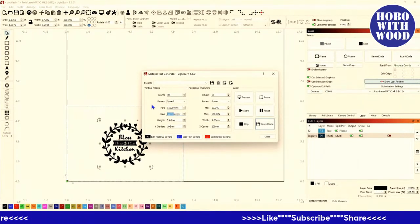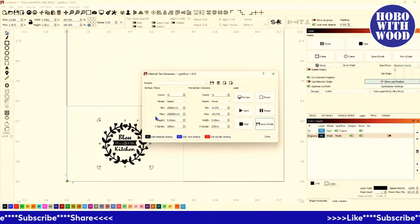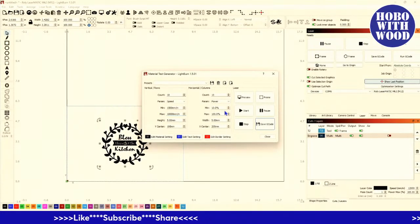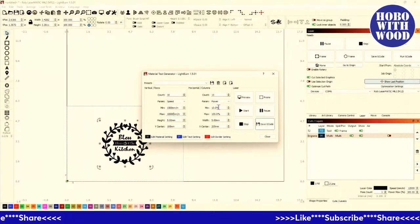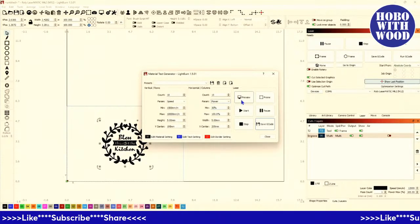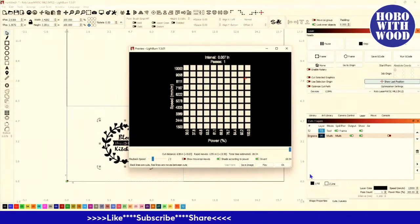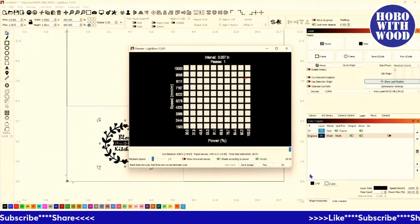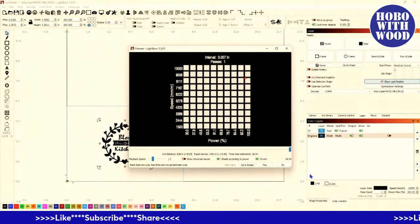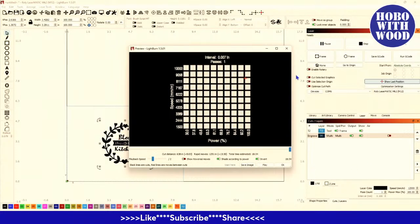I really started trailing off at about 10,000. Now, I don't know what your laser's capabilities are. And then for the power setting on my 10 watt, there really was no need to do anything less than probably 30 percent. So then maybe start at 30 to 100 percent. And that test would probably give you pretty good results scanning on your widest axis, 5 millimeters pre-focused with a 10-watt laser. That might be a decent test grid for the 10-watt.